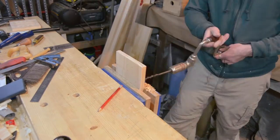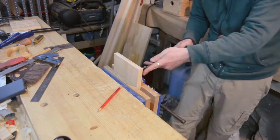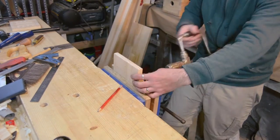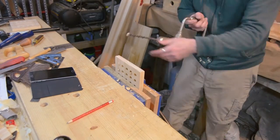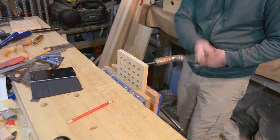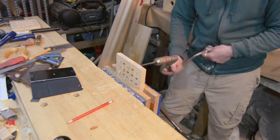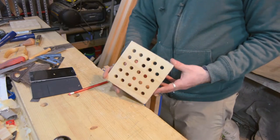This really only took about six minutes. I would tell you that if you can find a good brace-and-bit auger bit set at any flea market or yard sale, pick it up. You can sharpen them fairly easily and they just drill really nice holes.